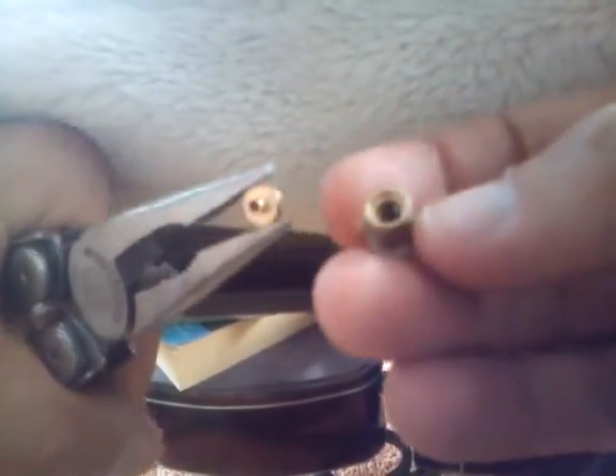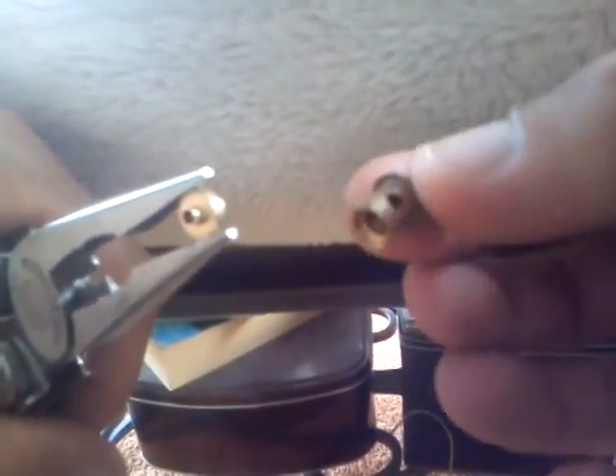This thing here — this is like an air mixing chamber. The jet squirts a jet of butane into here and then out this hole, into the rest of the soldering and torch mechanism. And here should be where our troubles lie. In here we have an itty bitty teeny weeny little hole which is probably blocked. I don't know where to get a replacement jet like this — it seems to be kind of specialized, maybe they're in a torch. Anyway, I think that thing's plugged and it's pissing me off.